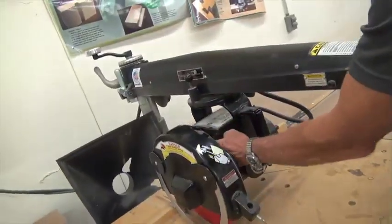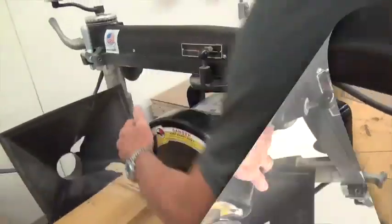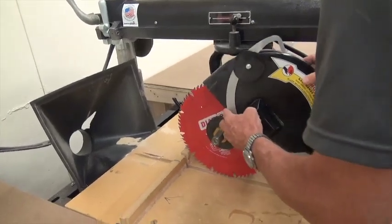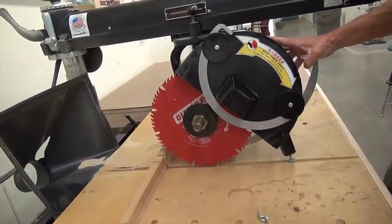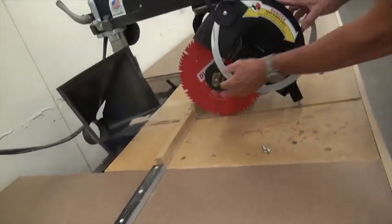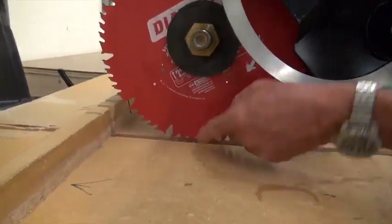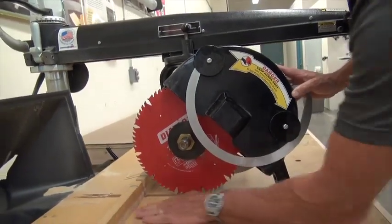Right down here is a wing nut. I'm going to loosen and remove the wing nut. So what we have right here is the arbor and this is the arbor nut. The arbor nut has to be tightened with a wrench — this is a big one here. Never tighten the arbor just with your fingers; it has to be tightened with the wrench. The teeth are pointing down and backwards because the blade is spinning in this direction, and it's going to grab the wood, push it down, and help pull it back.